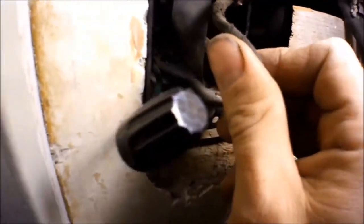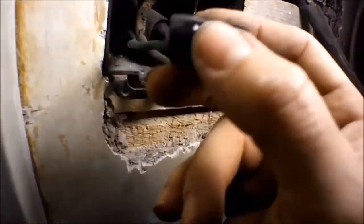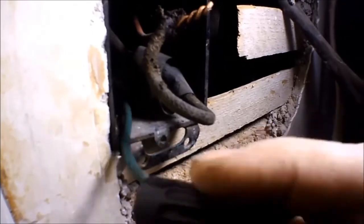Now I've got my wire hanging here. All I have to do is run a wire going down to the switch, run it up here, run it down there, and then meet in this light here. Then I'll tie it into that light, and take another cable to run to the lights over here. For the old wiring that's up in this ornament, I found a wire to it — it's this little old wire here with a red wire in it. I know this wire is the one for that ornament because when I disconnect it there's no power up there, and when I connect it there's power. That tells me that's the wire. There used to be a switch here for it — this is the power in.